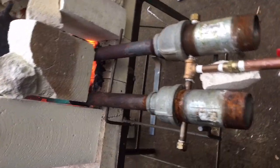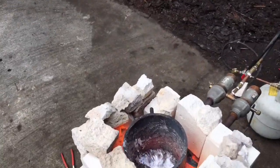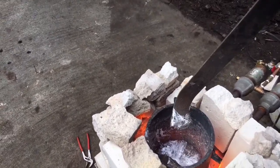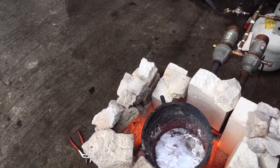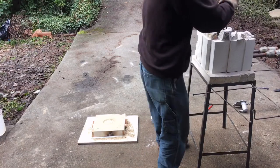Then we come out to my torches — just teed off a regular old propane tank. With the foundry up this high it's a little bit harder to pull the dross off, but you can see the little bits in there. I skim the dross off so there's a nice shiny surface in there for the most part. I'm just about ready to pour. Some people put in flux like borax to de-gas it, but there's not that much aluminum in there that I need to worry about that, so I'm going to turn the gas off.